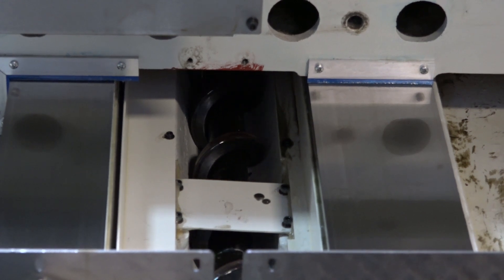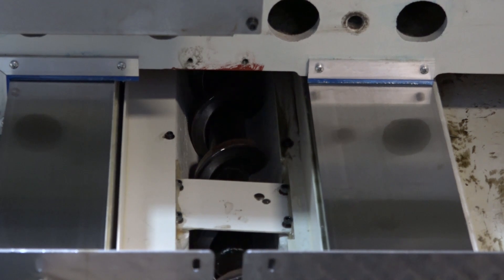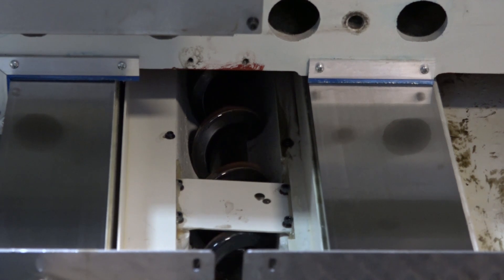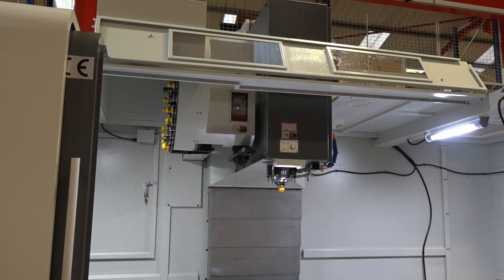With the large capacity available and the weight that you can put on the table, there's a guarantee you're going to create a lot of swarf. Swarf removal on the Super Heavyweights is helped by having two swarf augers that feed the swarf to the front of the machine. The standard conveyor and bin means that swarf is then removed out of the machining area, allowing your operators to keep the machine machining for longer. With its insatiable appetite to accept large and heavy parts, the 2010 has a moveable section on the roof that can lift out of the way so that you can sling large heavy parts onto the bed safely and more efficiently.